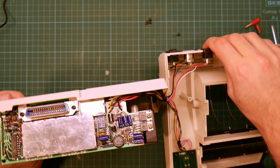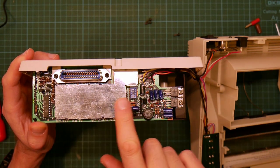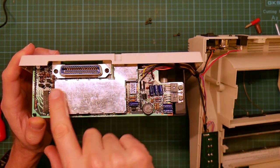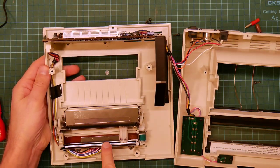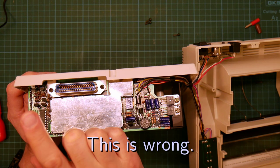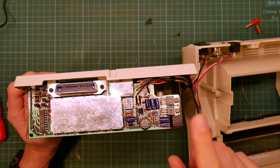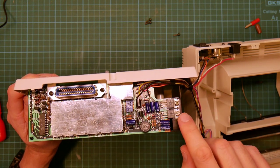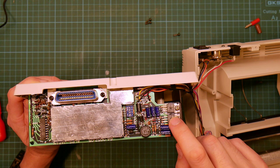Here is the PCB that makes it all work. The actual electronics are in here under the shield. We have some power transistors. Over here we have some more transistors. These are connected to the bundle of cables that goes to the print mechanism itself. So I believe that these are the amplifier transistors that drive the stepper motor signals. Actually, I'm sorry — these are not power transistors. These will be the voltage regulators that power the board off the DC supply. I can see that they are both HA17805s.